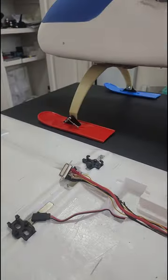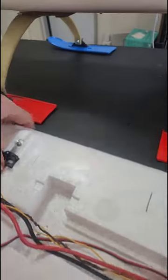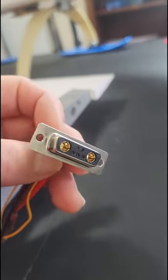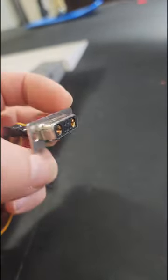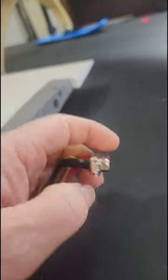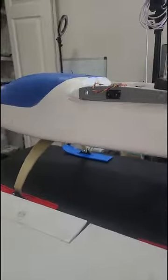But I made the mistake of putting this wing down this way up. I think what happened was that this connector touched the surface, and some water got into one of these little holes here. And then when I plugged the plane together and powered her up, I had a short. I think that's what it is.